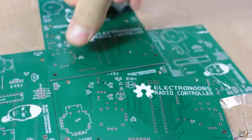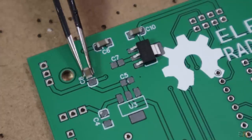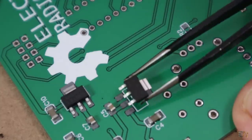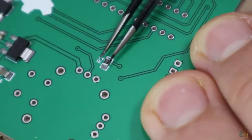It is time to place the components. You will need some tweezers to do that. Carefully place each component and don't worry if it's not perfectly aligned — when reflowing, the components will be dragged by the paste into their place. So don't worry about that.